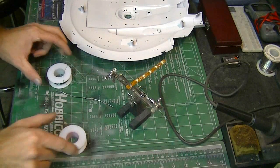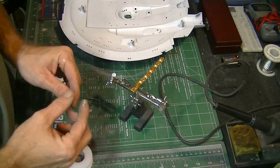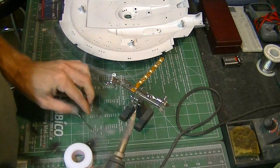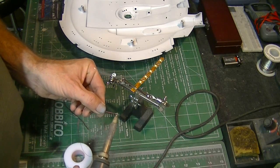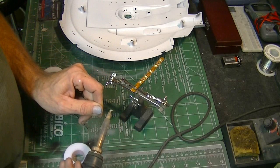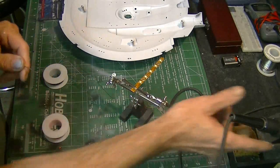Here we are all set up and ready to go. I've got my LED tape mounted in my helping hands. I'm using some good old trusty magnet wire in red and green — this is right around 30 gauge wire. What I'll be doing first is tinning up my wire: just put a little bit of solder on your tip and let the wire rest on that. As soon as that little puff of smoke comes off you can see it's all nice and tinned up. With magnet wire, if you've got a good hot soldering iron, it does not need to be stripped at all — you can just melt that insulation right off.